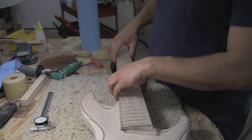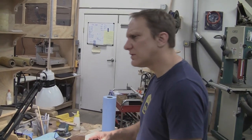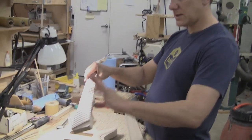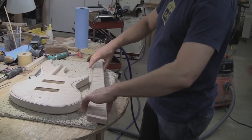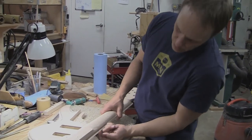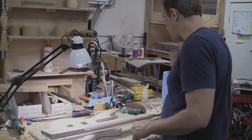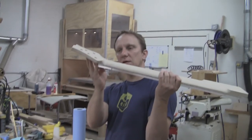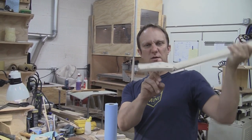I grabbed this template because this is how I cut the neck shapes out. This is an old one but I have a new one I use for these now. Basically the neck starts as a raw slab of wood — square, with the fingerboard on it but slotted. I double-stick it onto here and take it to the router table where the bearing rides on the template and the cutter takes the wood off. I step the bearing up a little higher and run it again. The problem with these necks is the tilted headstock — it's not like a Fender style — so you can't run a bearing all the way up; you have to handle that area separately.